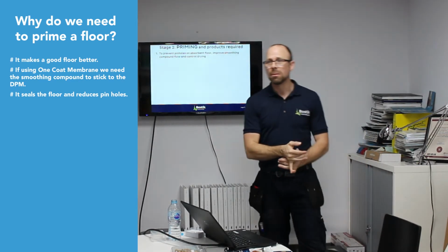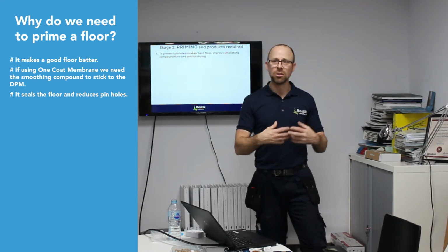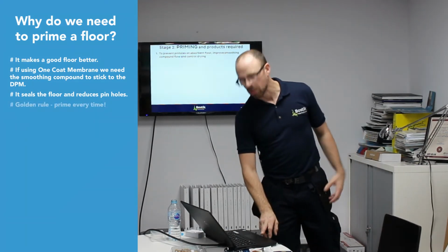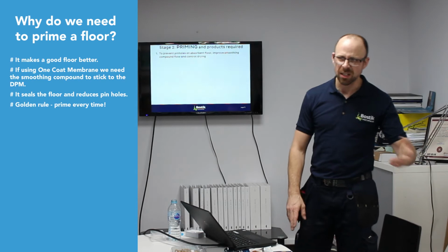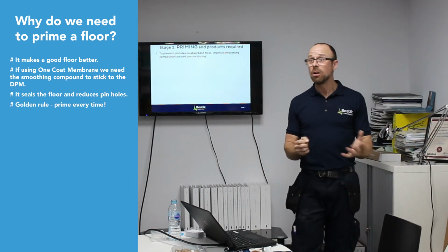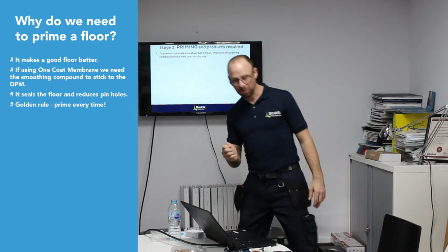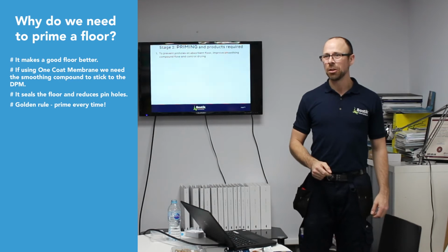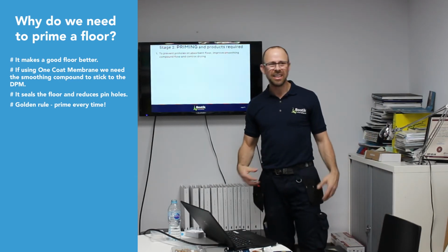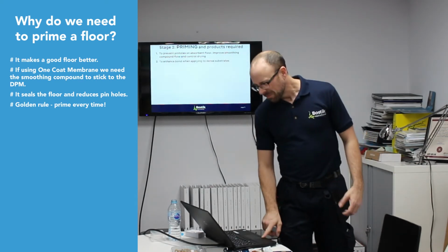A lot of people go, I don't need to prime. There are products out there on the market that say no need to prime, but priming just makes a good floor better. So prime every time was our rule. It's a crime not to prime. Prime every time. We've got little rhymes and all that. And when that job goes belly up and the technical rep comes out and goes, you know, that job should have been primed on that one. So it's best to prime every time, really. It doesn't take that long to prime.